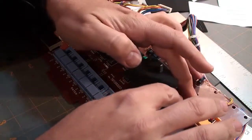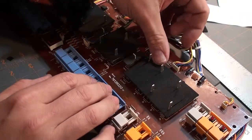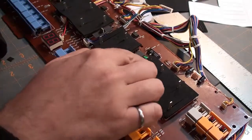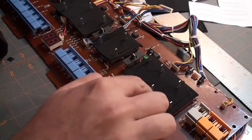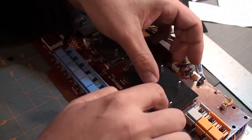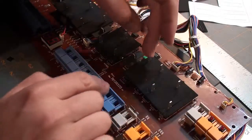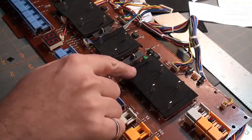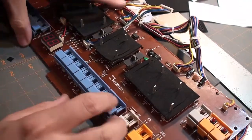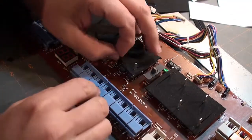One way of ensuring everything is aligned correctly is to alternate the sliders like that. Okay, and I'm pressing down now a little bit more forcefully just to ensure we've got a good mating between the neoprene and the material. But as you can see, this adhesive works really, really well. See how that's laying flat now? And it's just going to stay like that because it's a high viscosity adhesive. It'll harden overnight into kind of like a rubbery silicone.